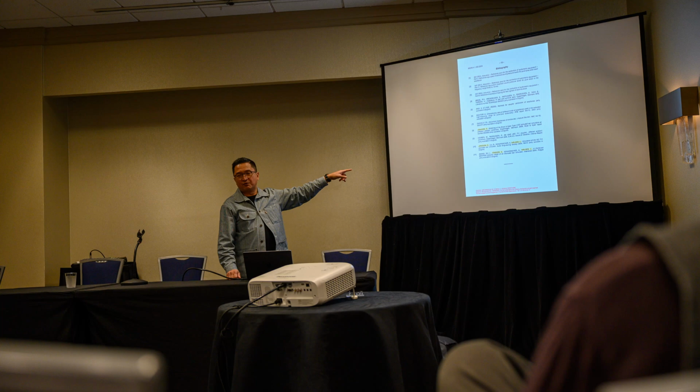At Brüel & Kjær, Per Brüel already worked on a simple 1-branch design based on his own measurement and available ear simulators at the time. He was a pioneer within standardization. This is their words. And at Brüel & Kjær, a decision was made to design a stable coupler meeting the target response of both IEC and ANSI. This led to an occluded ear simulator with a suggested 2-branch realization as described in what became IEC 711, standardized in 1981. The Brüel & Kjær 4157 was elegant in design with narrow air gaps replacing metal discs, very stable and with no adjustments needed once assembled. It gradually took over the market.